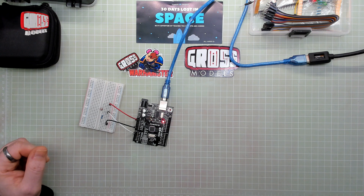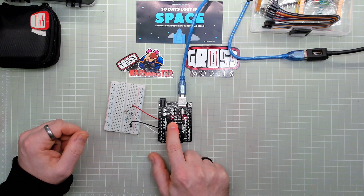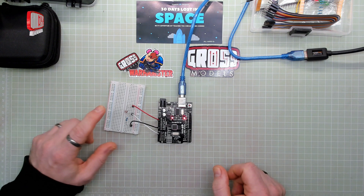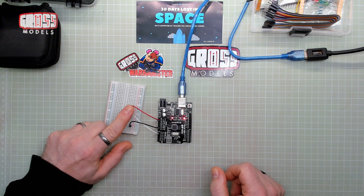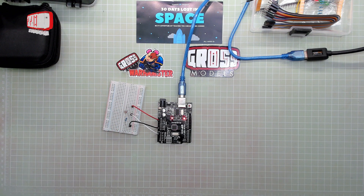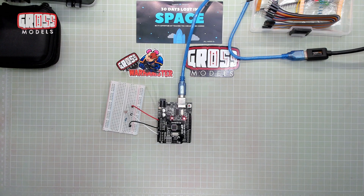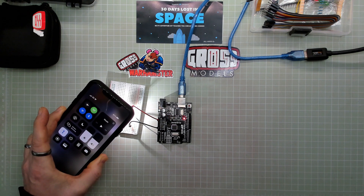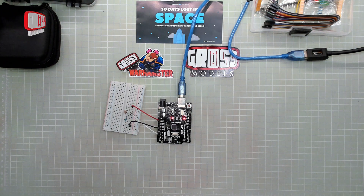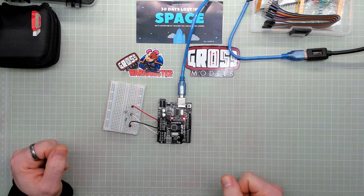So we've now got the numbers still coming through, going low when I put a finger over it — and it's coming through a lot slower when the number is high, and quicker when it's a low number, because of the delays. Let me show you what I've got on the bench here. You can see the onboard LED there flashing at a steady rate because it's fairly bright. If I make it darker, it flashes quicker and quicker. And if it goes almost completely black, it's flashing so quick it almost looks steady. And if I put an extra light on it, it will go to a very long delay between being on and off. So that's pretty much it for this week. Thank you for watching. I'll see you tomorrow for more.